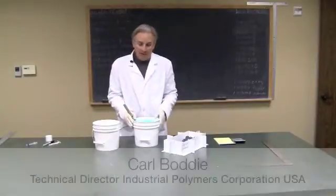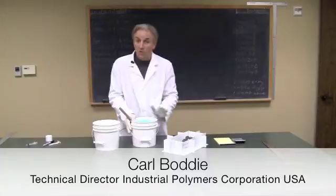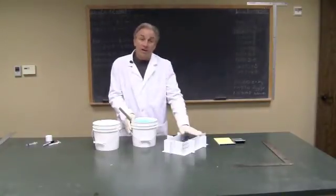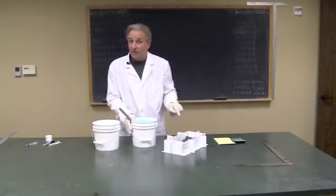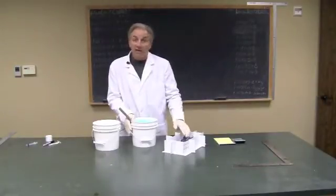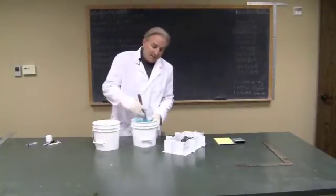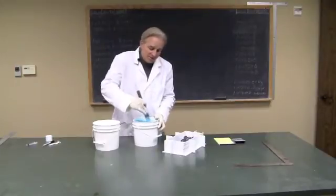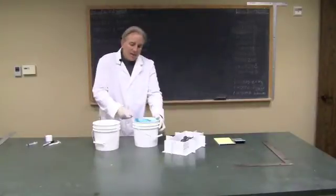I've measured up my part A and part B, and found it to be about a little less than a gallon of material — about three-quarters of a gallon. Don't forget to take out the volume of your piece. You figure the volume of the box to figure the rubber, but also you need to guesstimate or get a hard measurement of the volume of the piece you're going to overcoat and make a mold out of. In this case, I figured it was about a quart worth of material for the master, so the outside is going to be about three-quarters of a gallon.